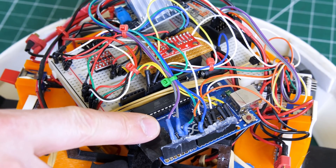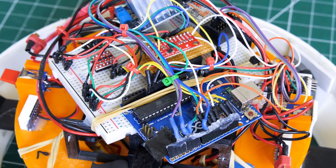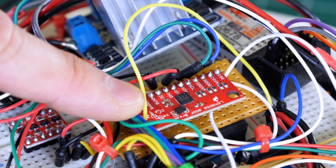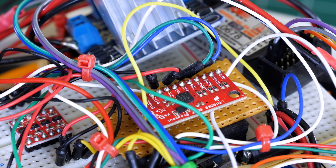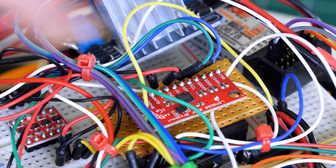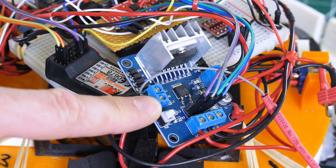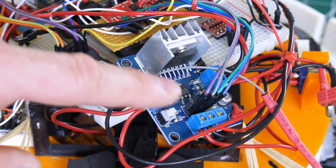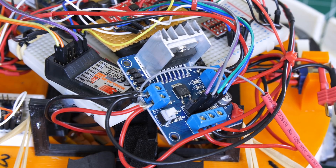Around the top we've got an Arduino Uno dealing with the balancing — only 8-bit at 16 MHz, but still enough to make a balancing robot. The inertial measurement unit is a SparkFun device; we can read the gyro and accelerometer data but have to do our own maths to combine them, which isn't as good as the results from an MPU-6050 that does the DMP on board — which is what I've been using in subsequent builds. The motor driver appears to be an L298, dual channel at about two amps per channel — functional but an old and inefficient device.